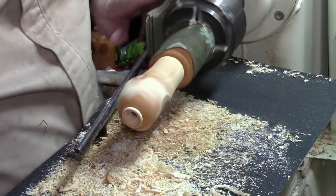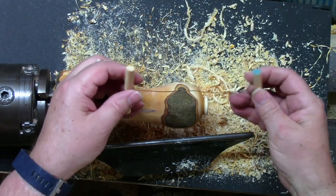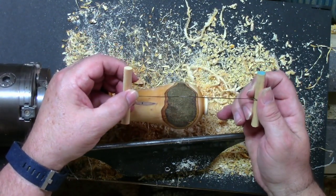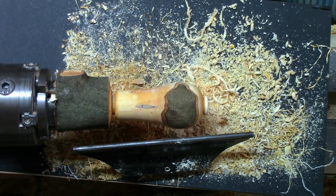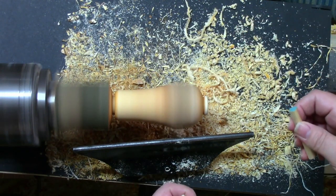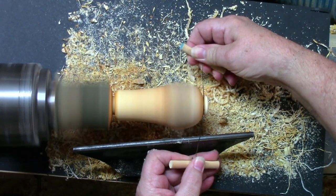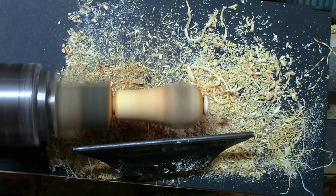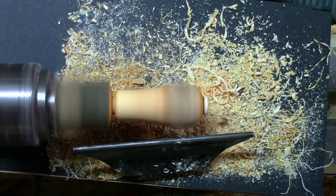Speaking of looks, there's one more thing we can do. Go ahead and switch over to the upper camera. This is two dowels with a piece of guitar string in the middle — I use it for burning the wood, and I'm going to put a ring right around here. Don't use your fingers — make sure you get some dowels if you're going to do this. Just pull it right down there, you'll see it start to smoke, and you know you've got a nice black ring. It's just another little accent to make it look a little bit nicer. With that said, I'm going to go ahead and part it off. We'll slow the lathe down just a little bit — we don't need it running quite that fast to do a parting job.